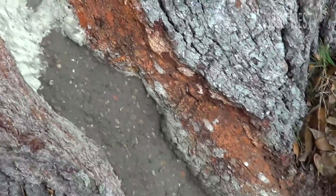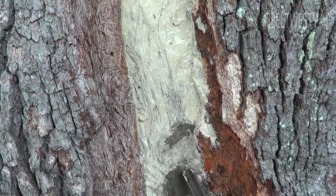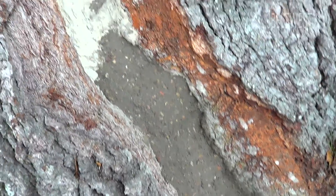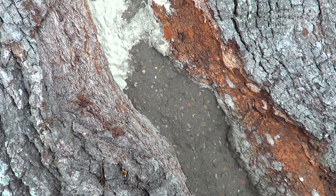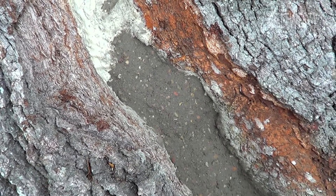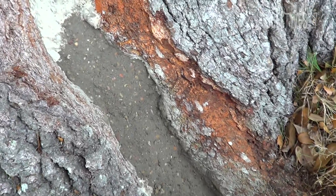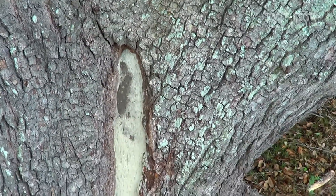This is the line through here where the outer coats are covering up, so all it's got to do is close the gap between these two. This went in here almost a whole foot and that's just been filled with QuikCrete — we dug out all the part that had some bugs in it down to clean wood and then filled it all in here, packed it in tight. I'll probably paint that later; you don't really have to paint it, but sometimes it just gives you a track of where there's any weird activity going on.